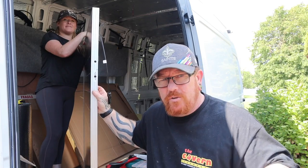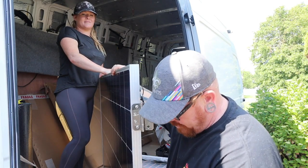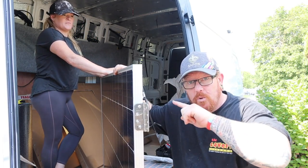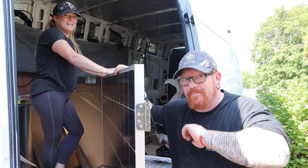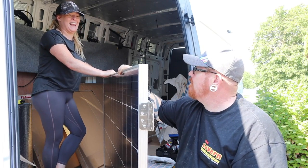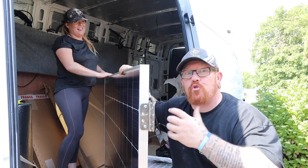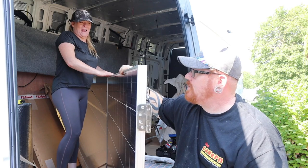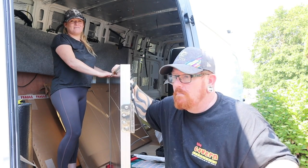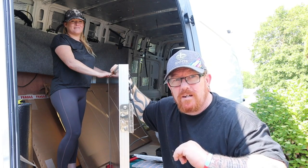We are going to try and make our solar panels tilt, but we're not going to be buying any sort of fancy tilt mechanism with bells and whistles and motors. We have put fire door safety hinges on one side of the solar. On the opposite side we're going to have an L-bracket with a big knob in it, and the big knob is going to screw in. It's pretty simple, it's pretty easy - it might be a little bit caveman but it's going to work. Trust me, it's going to take us five minutes.